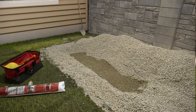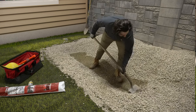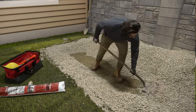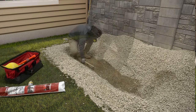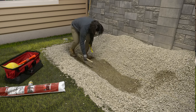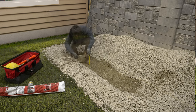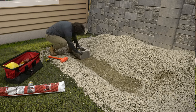When working with step ups you will need to dig a trench that is deep enough to accommodate the base material and extends into the slope far enough to bury one full block. In this example we are going to show you how to do this properly and maintain stability. To begin we already have our base rock in the trench and it is compacted and level. This should also include the excavated area where the step up will be made. Using a string line for alignment, place the first block in the center of the trench with the raised front lip facing up and forward.